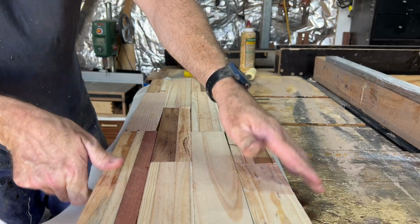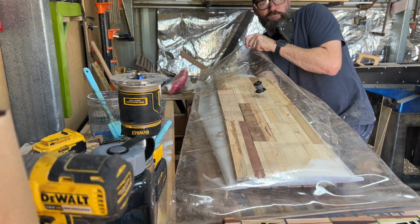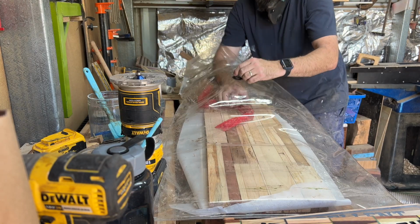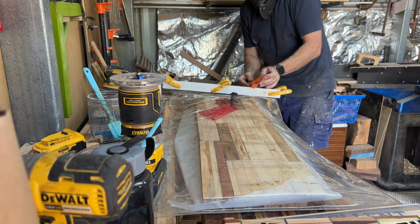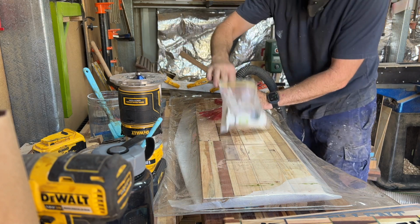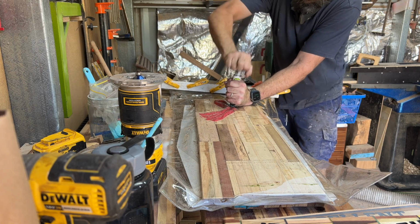And just quickly, these vacuum press bags are actually a really versatile clamp to have in your shed. It's not just about sticking veneers onto things or making skateboards. You can use those to clamp all sorts of boards together to create all sorts of stock. You're getting an amazing amount of pressure inside of that bag. So for example, you wanna make some chunky beams, you've only got 2x4 stock, laminate them together, stick them in your bag. If you don't have enough clamps, these bags do the exact same job really well.